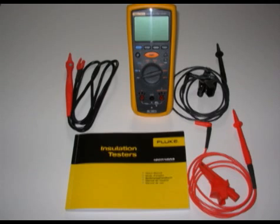I'm sure there are other automotive applications this tool could be used for, and I'm really looking forward to finding out what they are. Basically, you're applying a voltage — specifically a highly regulated stabilized DC voltage — across a dielectric, and you're measuring the amount of current flowing through that dielectric, and then calculating, using Ohm's law, a resistance measurement. What we're really talking about here is leakage current.